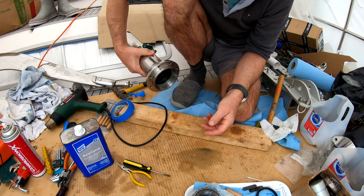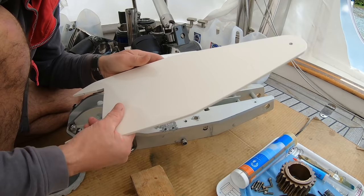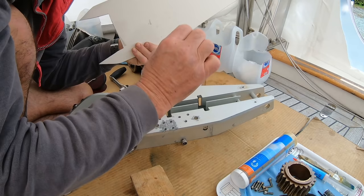This one is ready to go up the other end of the main housing when I get that one ready. It's top of the mast. As you can see, there was a lot of corrosion on here where people put different fittings. The Windex fitting was corroded through. Plus, all the water, rainwater, goes into here and down through the middle of the mast.